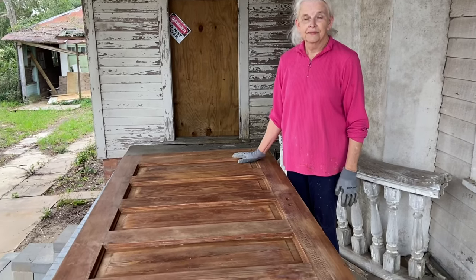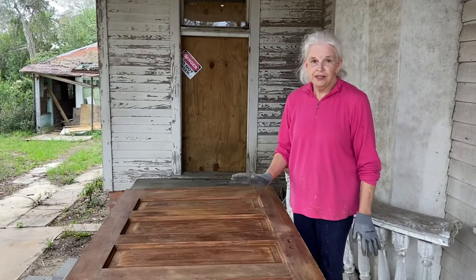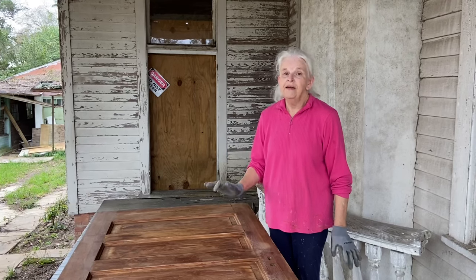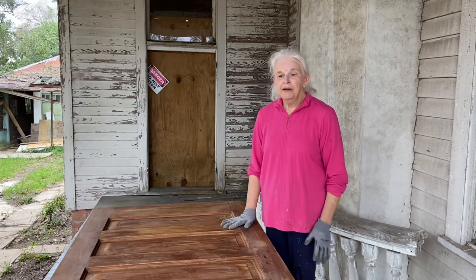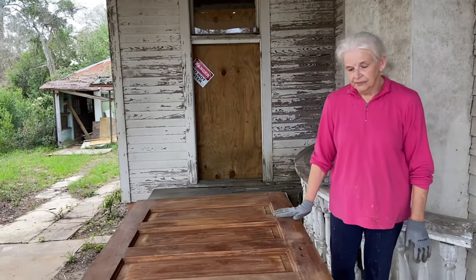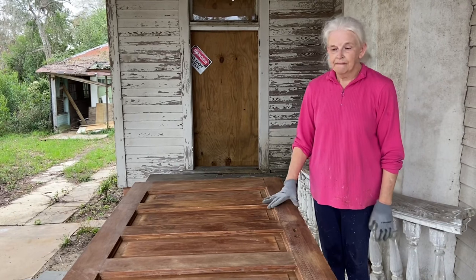So Mother, to say a few words about the process of cleaning the other side of one of the world's dirtiest doors. It was so much harder because it had primer on it. It involved stripping with a stripper, and it involved sanding and picking. But I think we about got it. I think when we sand it, it'll be ready to put the final coats on it. Yeah, and we also took the first layer off with the speed heater. So we did use the speed heater, but it just wasn't as effective on this. Probably from our own making, but anyway, there's the other side.